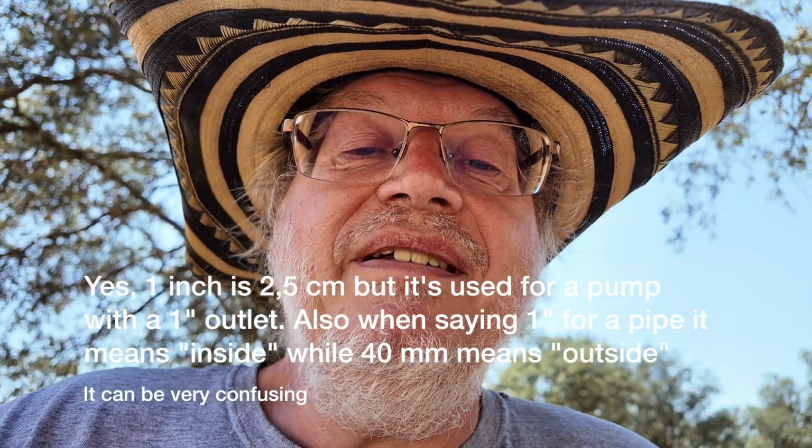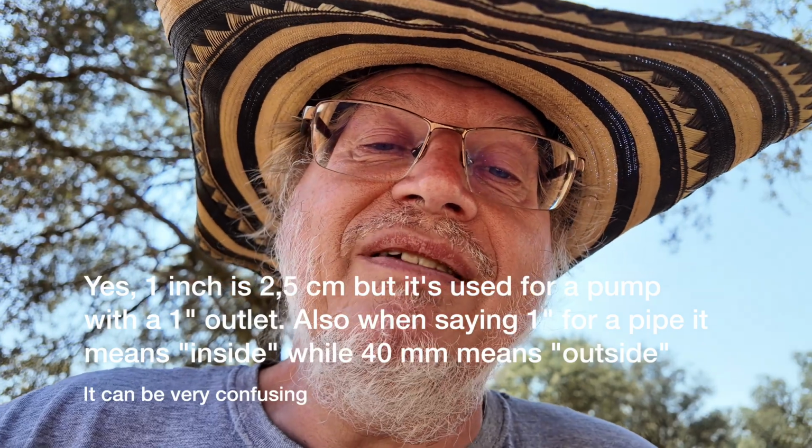And then, once we have this, I don't have to come out here and make the switch from delivering water to the farmyard or to Zone A for irrigation. And later, when we have the other pumps and the extension at the end, the other pond, then this will continue to be useful, but we probably need to change the diameter of the water pipe. Right now it's probably a 40 millimeter pipe. Let's call it 1 inch. And the other pump likely has a 2-inch attachment, so it can deliver more water in a given period of time. Which is also why we are using the pipes that we have for the moment and replacing them when they burst, because we know that eventually we will install a different type of pipe that is bigger and rated for high pressure. Now that we learn what we need, we can actually plan for it.